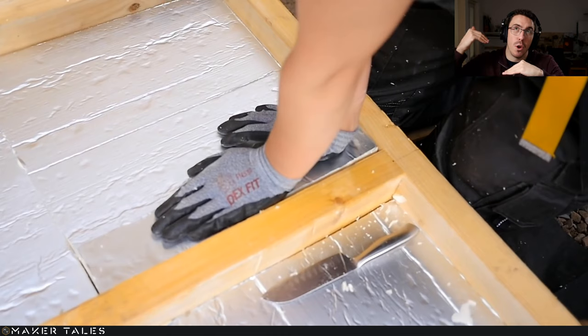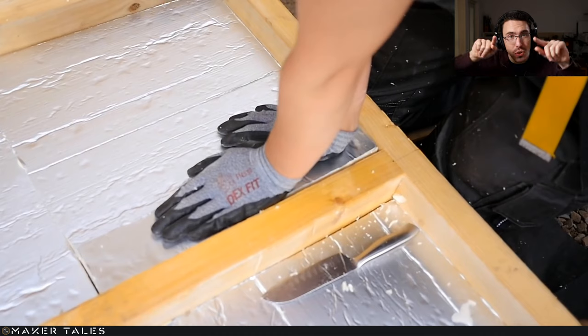However, what I was thinking logically is that if I were to just leave a bit of air there, then at least the moisture trap is just on the Kingspan and not my flooring itself. So yes, I could definitely still have moisture in there, but at least it's not going to affect my floor as much as actually touching the floor itself. This is why not only is it pressure fit super tightly, but I also seal around all of it using metal ducting tape.